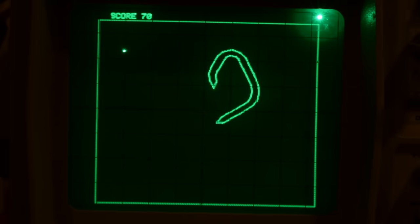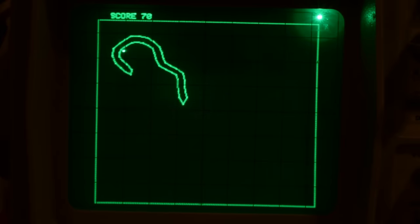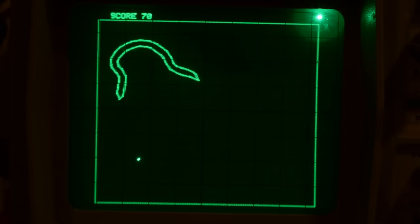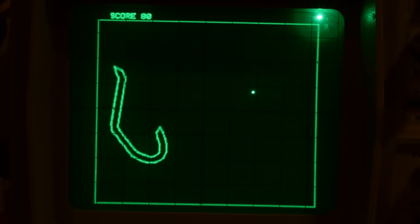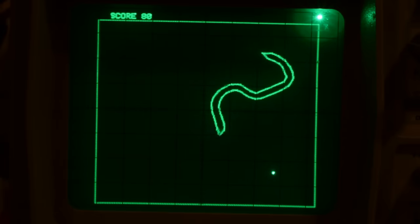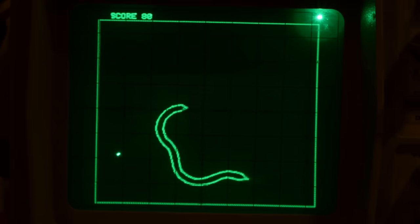The sound hardware is a very loose approximation of what you might find on a Game Boy. It's got three square waves and a noise channel. The noise channel really is just that, it's gating the output of a reverse bias transistor. I'm sure no one will be surprised to learn that I wrote a JavaScript utility to convert MIDI files into the correct binary format for the cartridges.